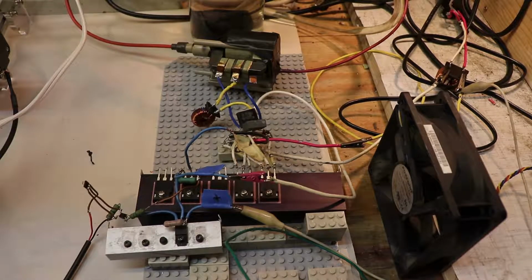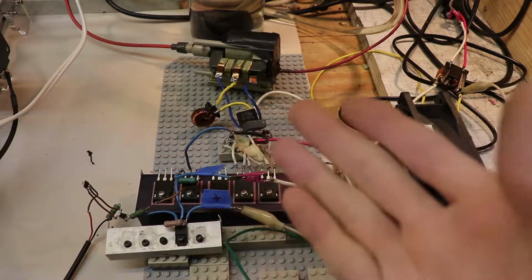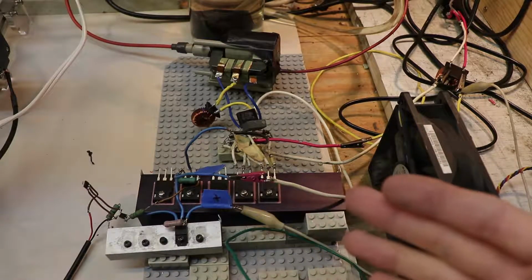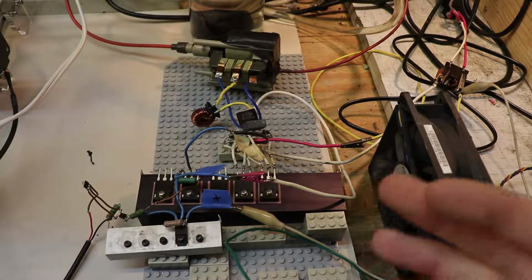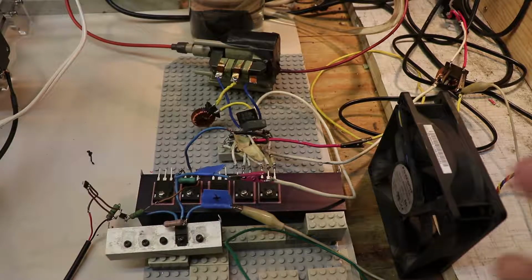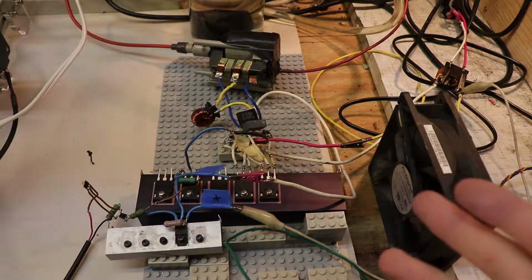And this is because previously the high voltage would leak out because it was not insulated well enough, and it would just mess with the low voltage stuff, and it would cause the laser to just stop whatever it's doing in the middle of an engrave or burn. And it would be extremely stressful to leave this machine alone to do its thing.